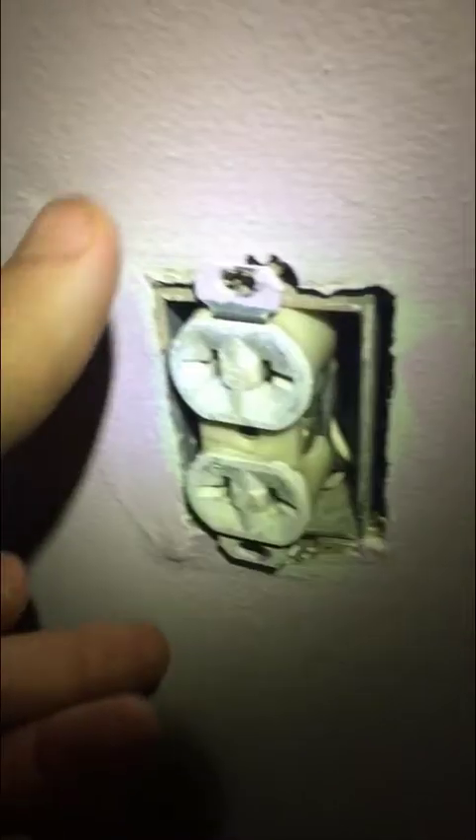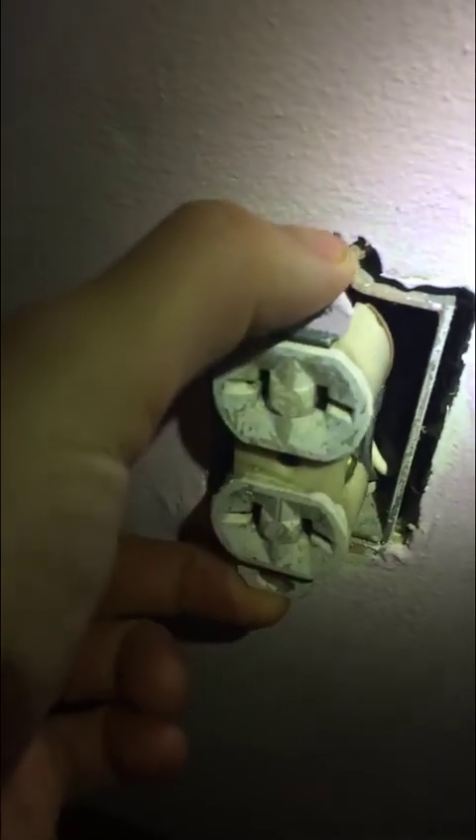So now what I'm gonna do is pull the whole thing out. What becomes apparent is we have four wires in there. That means that this outlet in particular is intermediate in the circuit — in other words, it's not the terminal outlet, meaning that it has a flow coming from the circuit box out to some other outlet. That's okay, but it can be a bit confusing.